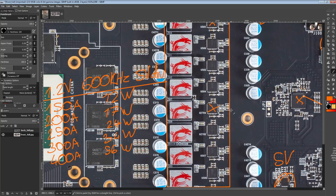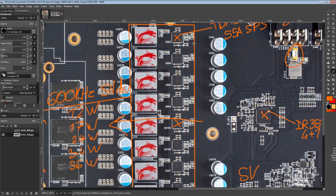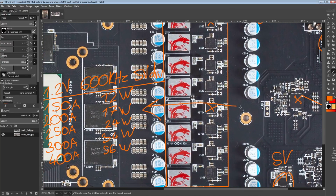You're basically going to have the issue that you're going to have a short circuit. It's very likely that you're going to have a short circuit to the output of the VRM. Now, these being smart power stages, that should be very, very unlikely to actually happen. But let's say it does happen. So you're going to have a short circuit from plus 12 volts to the output.